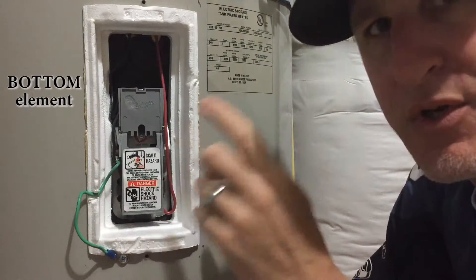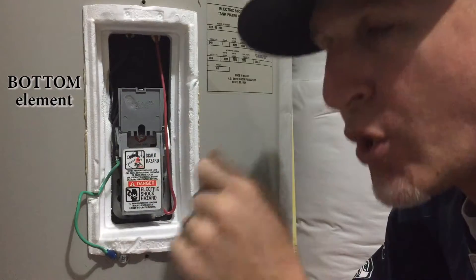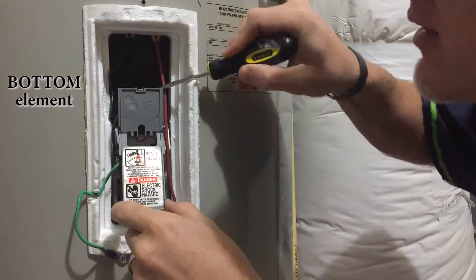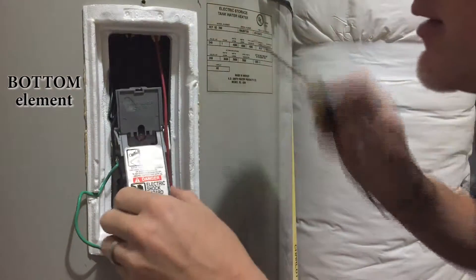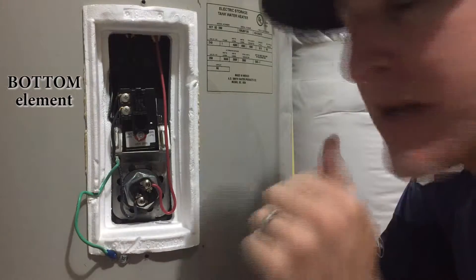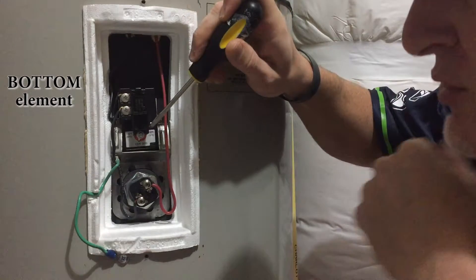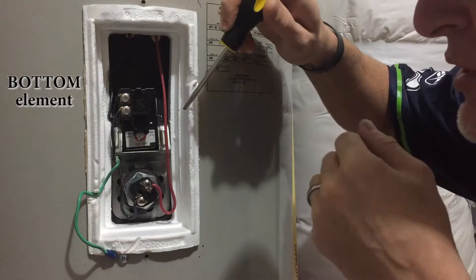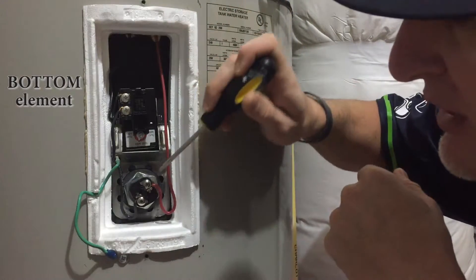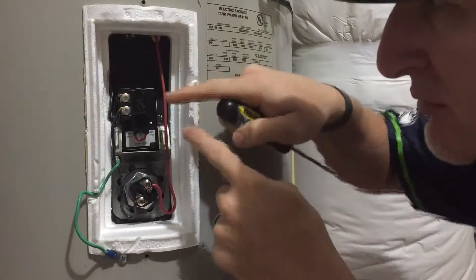So this here is the lower unit. There are leads coming from the top but there are fewer workable parts here. You don't have power coming in other than straight into the top thermostat. Take that off — just a little screw under this left back piece. Now remember this is high voltage, so everything you're touching in here is going to shock you. This is like putting your finger into an outlet, so don't touch this stuff until the power is off. Power comes into your thermostat up here. This will trip when it goes below 125 and it will turn on; if it goes above 125 it turns off. That power then connects and goes down to your element, which charges the element until it trips that off again when it reaches 125.